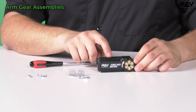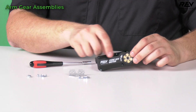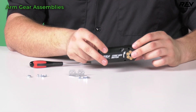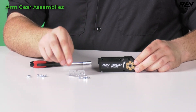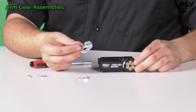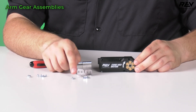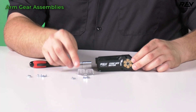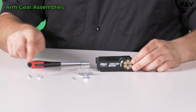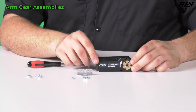Now let's move on to building our gear assemblies to power our arm. We're going to use the REV core hex motor — it has a 5mm hex bore that goes all the way through to both sides, and that whole shaft will rotate both ways. We're going to need a core hex motor bracket, the bent version, as well as M3 by 8mm screws to attach it, plus four M3 by 8mm screws with four nylock nuts to preload the bracket after attaching it.